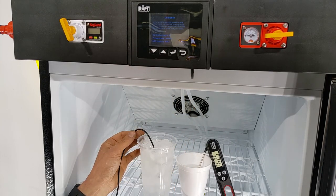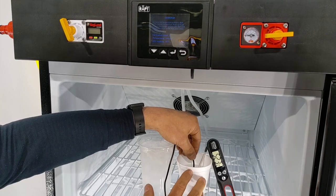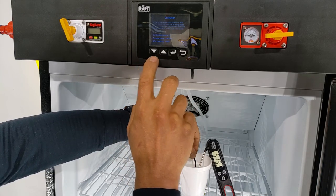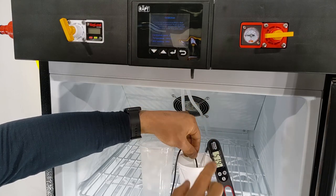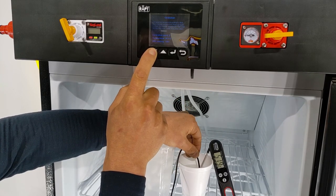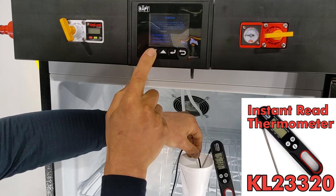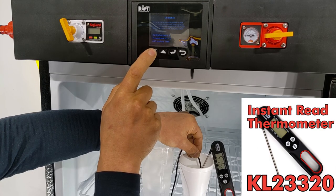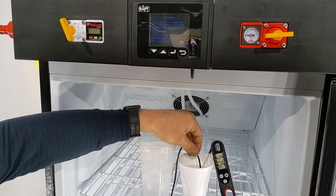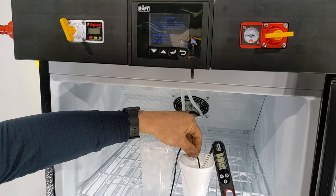Now you can see I've got to set the hot temperature, so I moved the probe over into the hot cup. I've got an insulated cup to try and hold the temperature as consistent as possible, and it's a good idea to do that for the cold cup as well. I've got 100 degrees as the default set temperature here, but my water is actually at 51.9, so I've got to go down to my water temperature, which I'm getting a reading off with my instant read thermometer to make sure it matches. It looks like it's dropped a little bit to 51.6 — it's a bit difficult because I am measuring a moving target here. It will help if the cup is quite large and has more thermal mass, so the temperature is not decreasing as quickly when taking a reading.